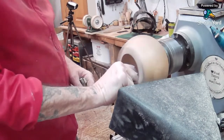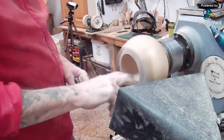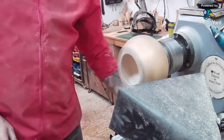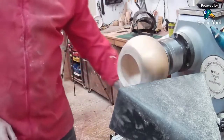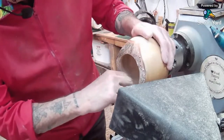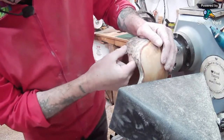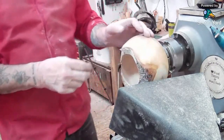I've just changed to a stick with a little pad on it just to put a bit more control around the edge there, to roll that edge over a little bit — my infamous rolled edge. Grin the Yorkshire Gritter is saying Steve Sinners' stuff is very good, designed from a wood turner's point of view. Something does seem to be lacking in some lathe designs — we were discussing earlier about the tail stock. The base of the tail stock should be behind the start of the quill so it's out of the way.